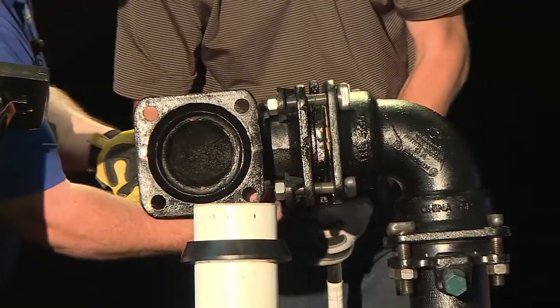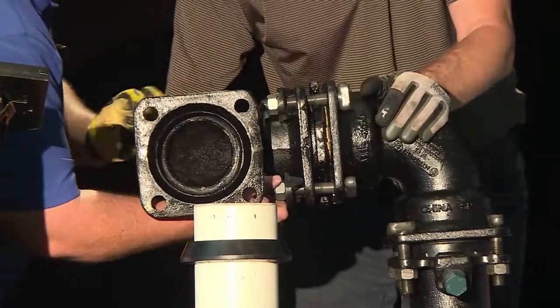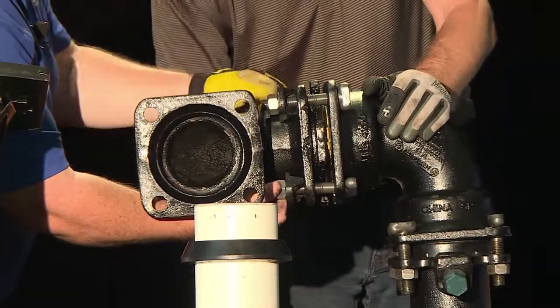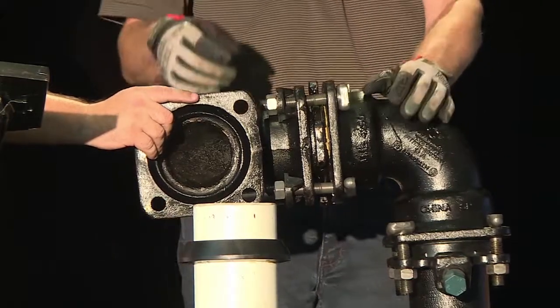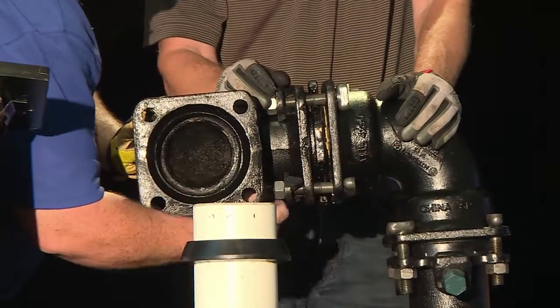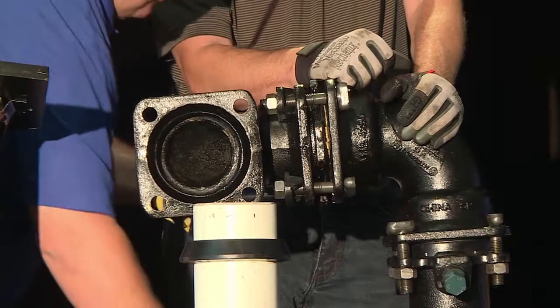Okay. So you can see with the MJ, with two fittings in this spacer, how quick and tight the joint has now become without any use for restraints or spool pieces or any other kind of length of pipe in the middle just to make the quick change. Yeah. So what we do is we torque this again up to 100 foot-pounds. I think it's 100 to 120 foot-pounds for this diameter. We set it at the 100 just for simplicity here.